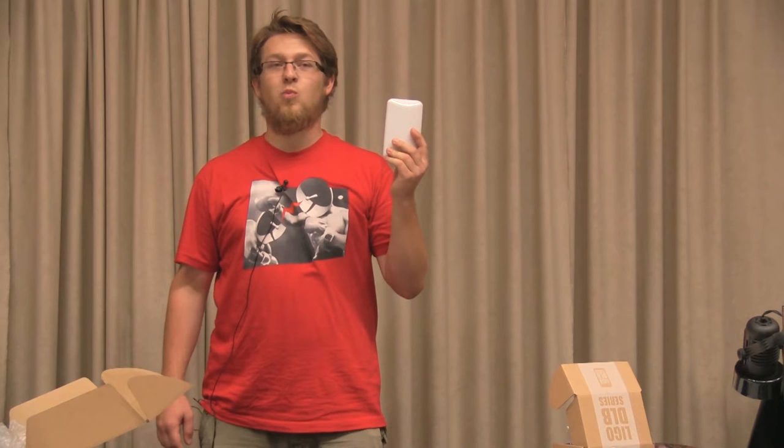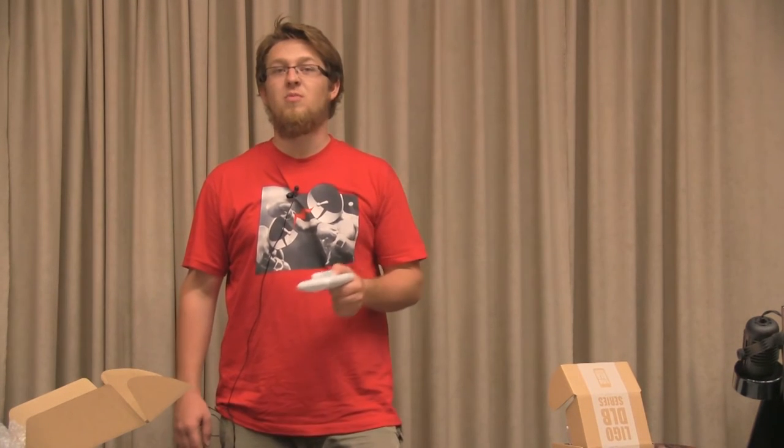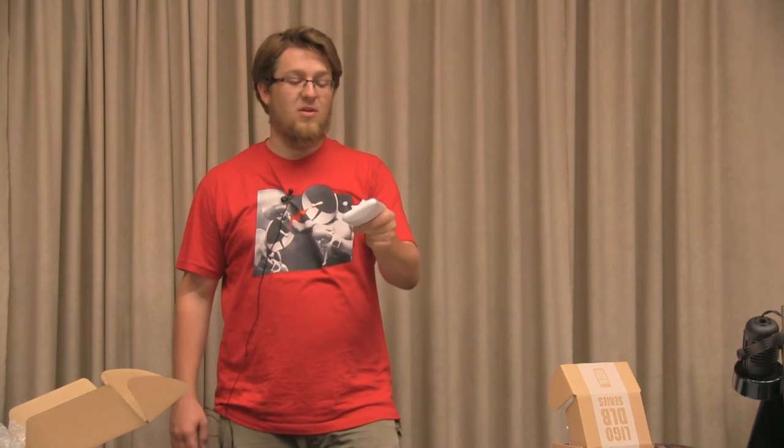What would be nice to do during this week is, we have those patches in our repository somewhere, work out a proper patch for these devices for OpenWRT. Someone needs to have a go at that. It's really nice to have dual firmware support and all that. But if you want to run stock OpenWRT, you would need to change the bootloader on these devices, which you can do either by first flashing an OpenWRT image, which you can then use to rewrite the bootloader directly, or having a serial port attached, which is not nice. But from our perspective, it's very good to have two firmwares on it in any case, so maybe we should keep that function.